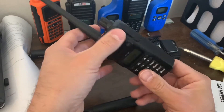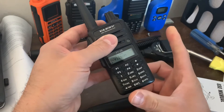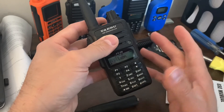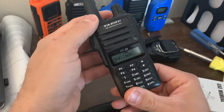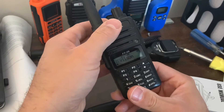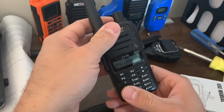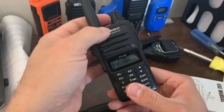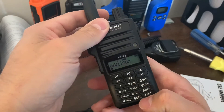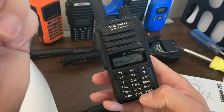I'm going to show you how to program this with a different offset. We can call it my repeater and then make adjustments to show a more unusual number. My local repeater is the Wilson repeater — 147.2 with a positive offset of 0.6 megahertz and a tone of 88.5 hertz. I'm going to show you how to use VFO A and VFO B with the VFO split to operate the repeater.